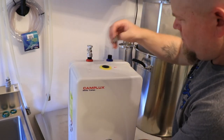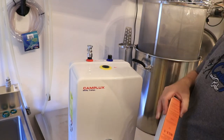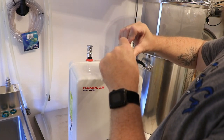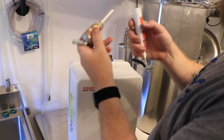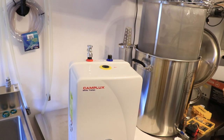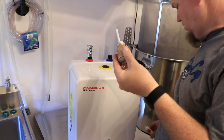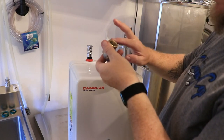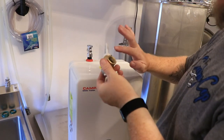Next step here is setting up the water heater. This is a Camp Lux water heater I bought on Amazon — I paid about $150 for it if I remember correctly; it's a four-gallon water heater. It's great for this application because I need just enough hot water to wash my brewing equipment. I'd rather save the wear and tear on my kettle element and just use a dedicated hot water source. I got some plumber's protective thread sealant and I'm putting it on this pressure relief valve. In case too much pressure builds up in the water heater, this valve will go off and spray water out. You're supposed to connect the pressure relief valve output to your drain — I do not do that, so I'm taking the risk of flooding my shed one day, but I'll take my chances; my floor is a fairly waterproof vinyl floor.